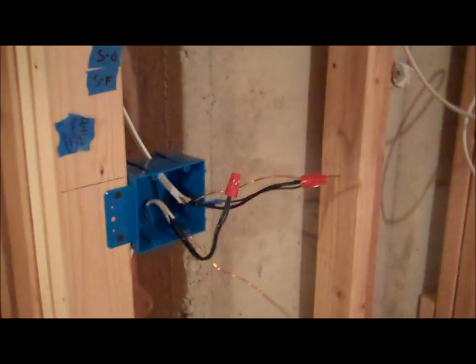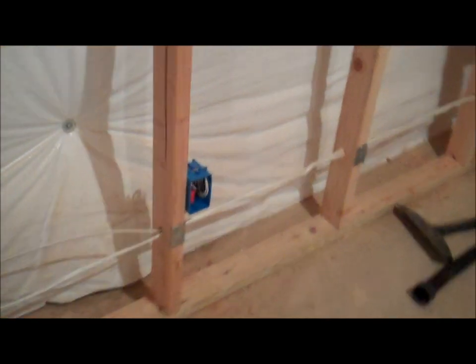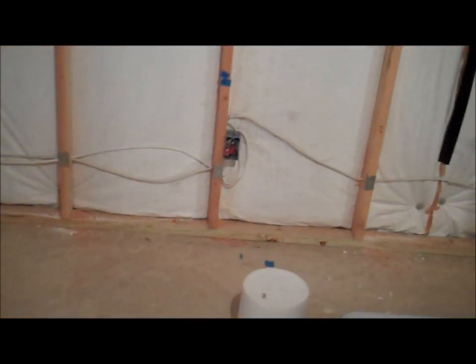Also had to rip out all the old cables for the wiring, which was kind of fun — and kind of a pain at the same time. In the bedroom there are a couple of switches for the light and a switched outlet. The coax cable is going to come down here. You can see the double wires: one wire runs all the outlets, the other goes down to the switched outlet and back around to the switch. I've learned a lot over the course of this electrical experience — it's been fun.